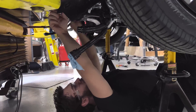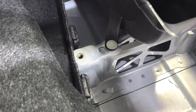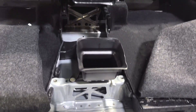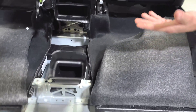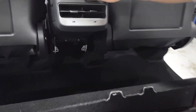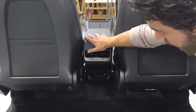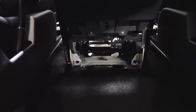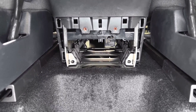There were 38 total bolts holding the pack to the body itself. There's a small riser here which interfaces with two feet coming down from the instrument panel — two stamped steel brackets. One of the unique features about how the battery pack with the seats and the center console is loaded in and assembled: the feet of those brackets would meet. At the rear, there are an additional two bolts used to hold the center console in place. Once the battery is installed, the center console is slid forward on rails to engage with the instrument panel, and those two bolt interfaces engage with a bracket on the battery pack itself.